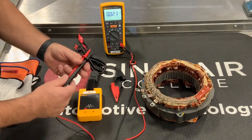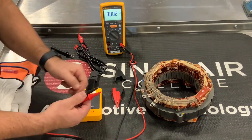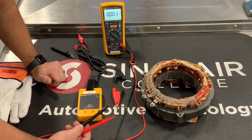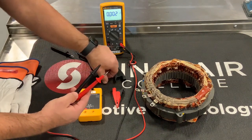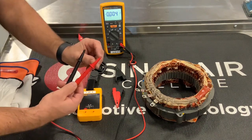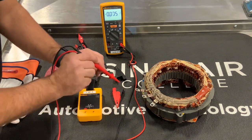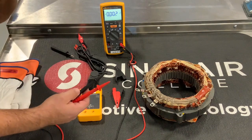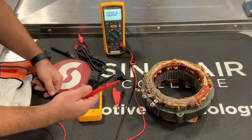I've got leads that are category 3, and any accessories I'm using are also category 3. These leads are shipped with small little covers. In my experience in the classroom over the years, these get mistaken for just covers and end up tossed in the box and they disappear. Those covers are actually supposed to be on there if you're using this as a category 3 meter — the idea is they limit the contact area so your leads can't touch two things at once. Those covers are actually part of the rating of a class 3 accessory. There are some other leads that are completely coated or have a contraption that spins out of the way — I have those as well.